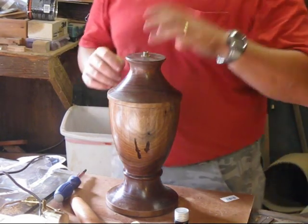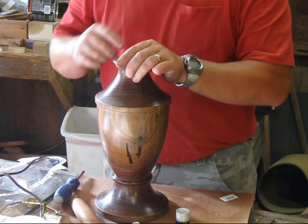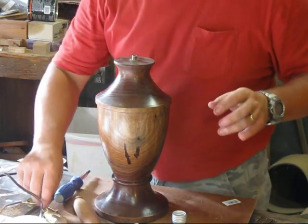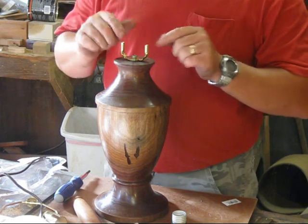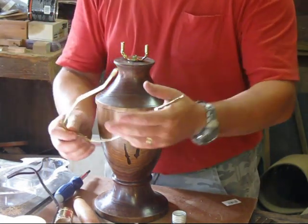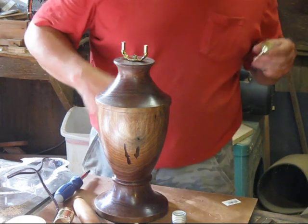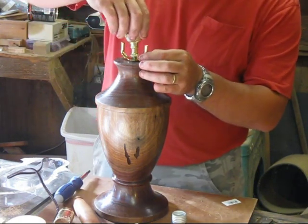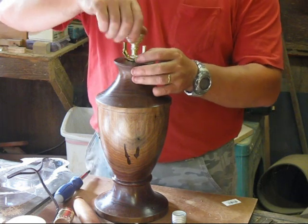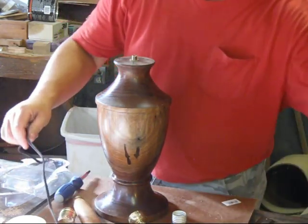I thought I was recording. All I've done is put my all-thread in, got a nut on the bottom, put the lock nut up on top and tightened it down. That's your lock nut - take care of that first. Then this little piece goes in - it's the very bottom of the socket, it squeezes together. Let me put my cord through there first - it might make life a lot easier. The cord goes in the little hole down here and I'll pull out plenty of slack to go up through the all-thread.